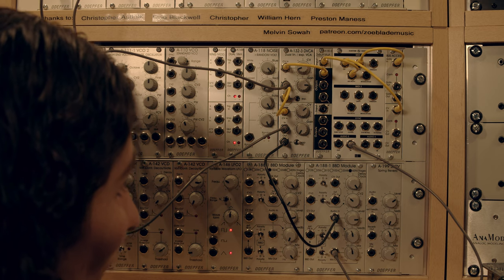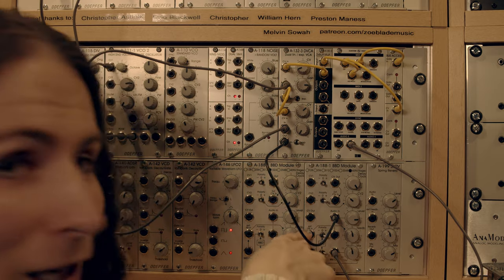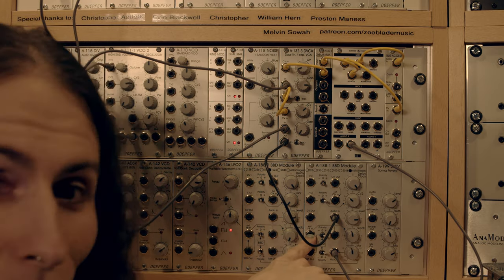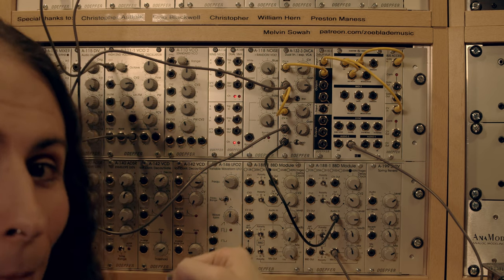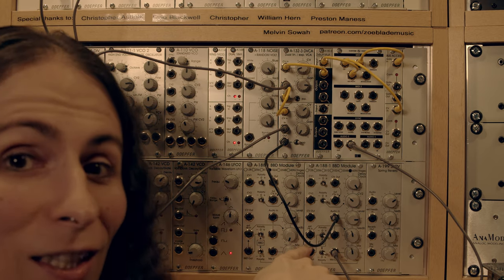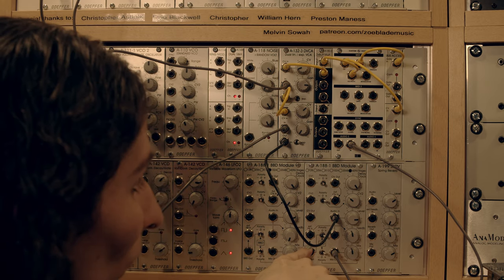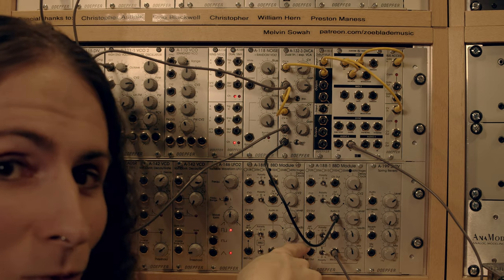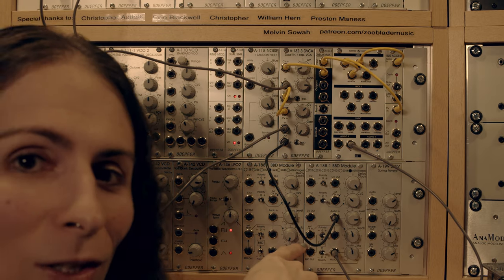And another interesting thing that I'd like to show you, looking at it now, is the FB feedback. We've actually got an output and an input for the feedback loop itself, which means we can send the sound away to a different module and back again, or to a number of different modules and back again, for each iteration of the loop. This is good. I keep on trying to find a tape delay because they're higher fidelity and the delay can be much longer, that has a feedback loop in it, and it's really difficult to find ones that do, so this is nice to have. Plus there's no moving parts, so this doesn't break.